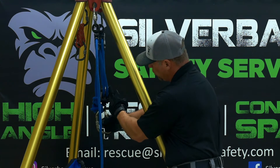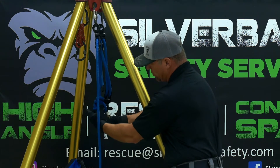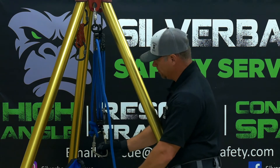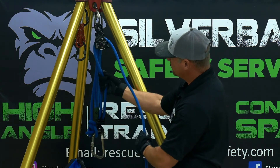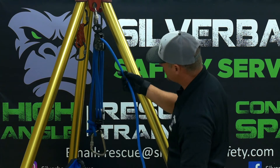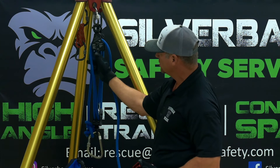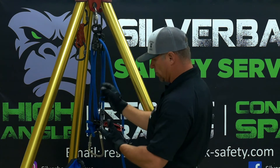Two points, two points, one point for your knot. So as it moves, it's a 5-to-1. At this point we'll need to reapply our safety cam. And remember, it goes over — the first time it goes over the pulley is where you want to put it.